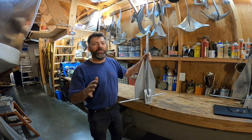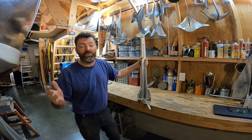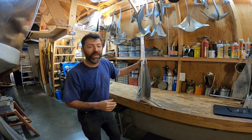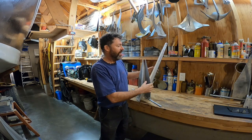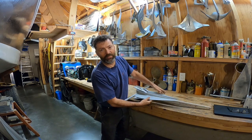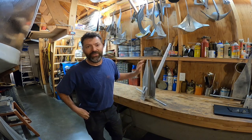There was even some corrosion sticking up, making the top of the fluke a little bit rougher. I've been noticing that this anchor's holding is fairly erratic — it would either hold just only a couple hundred pounds and release, or it would dive down and create over a thousand pounds. So I got to thinking, maybe the condition of this surface smoothness or roughness was having an effect. To test that, I glued sandpaper to the top of the fluke in its entirety and did a bunch of pulls; did a bunch of pulls in the natural state it's in; and then to simulate how it was from the factory — very smooth — I laid the anchor flat and poured clear epoxy on top of the flukes, let it flow out nice and smooth, and then did a bunch of pulls. I also did a bunch of pulls with the mud palms removed. So a whole series of pulls with four different conditions — but I'm going to be a tease and not tell you what happened. You'll just have to tune in next week to find out the results.